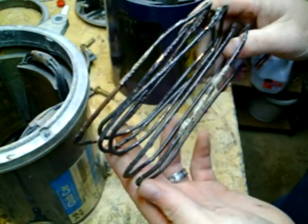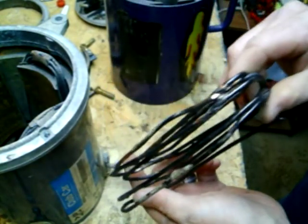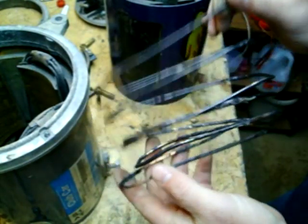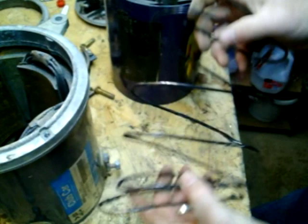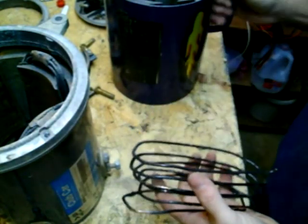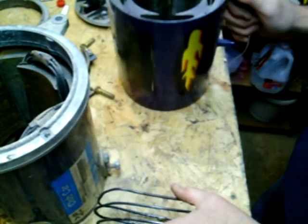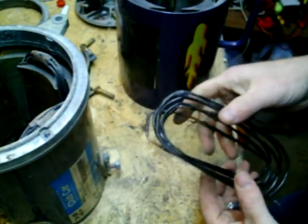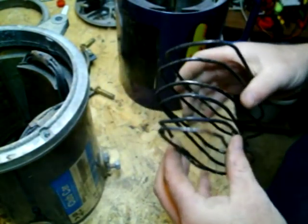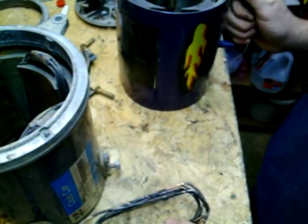This is one of the coils that came out of this — you can see it got pretty hot. Six turns per core, wound in a series from one to the next to the next to the next, with the S1 and S2 terminals in between. As soon as the wire I ordered gets here to rewind this, I'm definitely going to be putting up more videos for that.